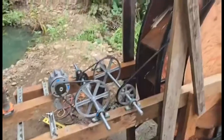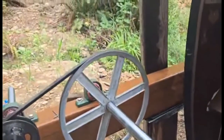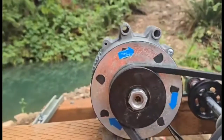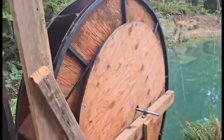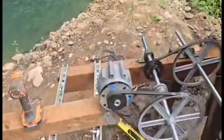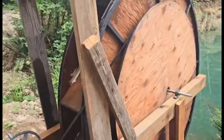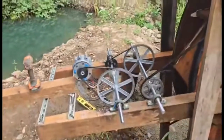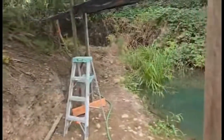Take number five: five-and-a-half-foot reel down to a six-inch pulley, up to a 12-inch pulley, down to a four-inch pulley, back to a 12, up to what I think is a three-inch. That gives me 103 rotations for every one rotation of this water wheel. When winter comes and we have the water flow we need, we'll see if it actually will turn the thing. Right now we've got maybe 15 gallons a minute in the creek — let's go ahead and turn it on and see what we get.